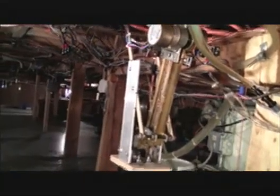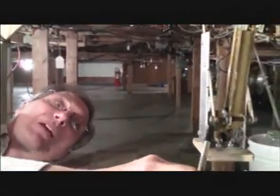Okay, I'm underneath the fire scene right here, and the fire scene is really filled with a lot of intricate little mechanisms to make everything work. This thing that hangs down right here is actually the unit that I built to make the ladder go up, then the man go up, and then the man actually chops. It uses 3 different motors. It uses a lot of little limit switches, like here. Here's a motor. There's a motor here on the other side. And then there's a motor down here at the very bottom. And this little bottom motor is the one that runs the guy that's actually chopping, his arm. And it just uses a series, like I said, of limit switches, so that once the piece gets to a certain spot, it stops, and then it reverses after a time.